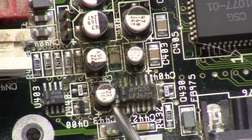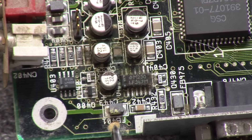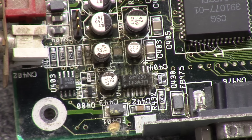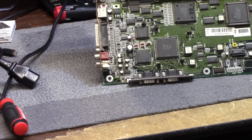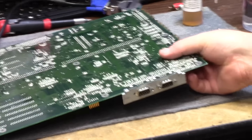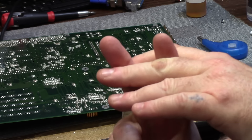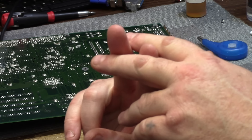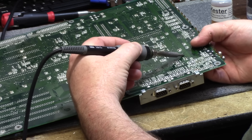They cause all of their juice to flow around and eventually acidically turn into goop that eats up these boards and the traces. There's something really hard right here — I don't know what that is and it's not scraping off, so we'll have to wet that down. There are a couple of through holes on this board, and usually how I do it: you can heat the area, or I like to just snip it down — snip the legs down of the through hole. The through hole capacitors when they're put in are usually spread or bent, and if you pull a bent piece of metal through a straight hole you could damage it, scratch it, rip the via itself. So cut them straight, then heat them up and wiggle them out.